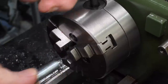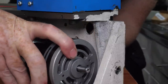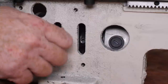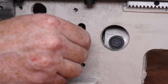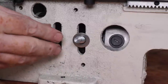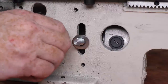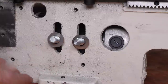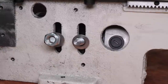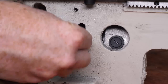With that thread finished, the studs are ready to be installed. The wide ends of the studs can't fit through the holes, so the motor needs to be held roughly in place and the studs screwed in from the far side. The studs aren't quite parallel, which looks like an issue with the straightness of the holes in the motor, but doesn't seem to matter too much. The slight damage to the threads makes it a bit difficult to get the nuts to start correctly. At this point the nuts need to be loose enough to allow the motor to slide freely, so I can adjust its position until the belt tension is correct.